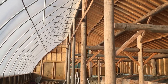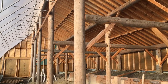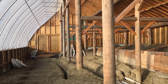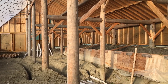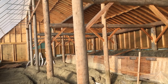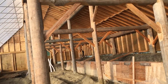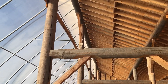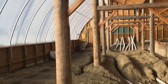These are otherwise destined to be telephone poles that were pre-stripped. I thought about getting tamarack due to its rot resistance properties and stripping my own logs, but they don't grow to this large a diameter that often, and stripping would be a lot of work. So I worked with some log home contractors. I gave them this design which I had sketched out on graph paper and said, can you guys help make me this structure, and then I framed and built basically everything else.